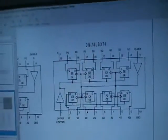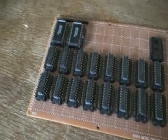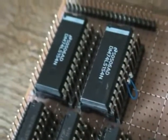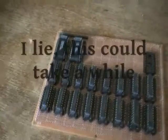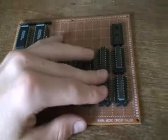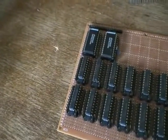An important pin is the clock, which is pin 11. Now that I know the proper pinouts, I can start to wire up — you can see I've already started. That's G1 and G2 on the 74LS154. I should have this board done pretty soon; it doesn't take that long to construct. One socket with the pin headers takes me about 7 minutes max, but wire wrapping takes a little while.